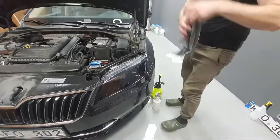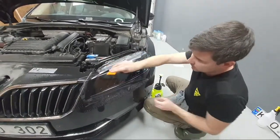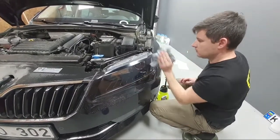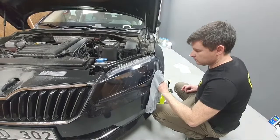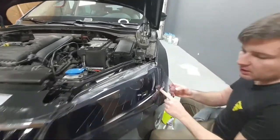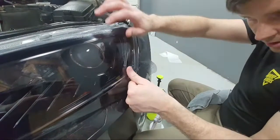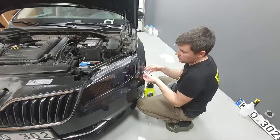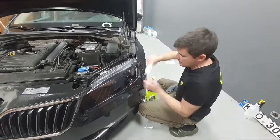Now when the entire surface is slid, let's use our cloth to look for bubbles. I have some bubbles on the top. Let's try to use a steamer to push this spot down — maybe it's going to help because the heat will activate the glue. In the other case, I can just do a nice trim on this edge and then push this air channel to the edge and it's going to stay there because I will dry all the water from there. Because now there's a tiny bit of water and it goes under the film straight away and the lift comes back. Let's grab the steamer.